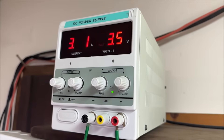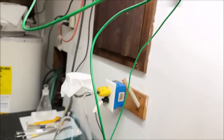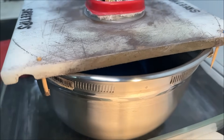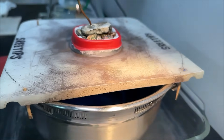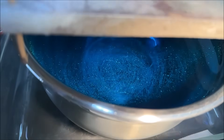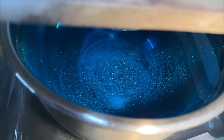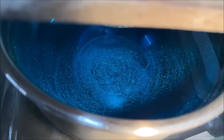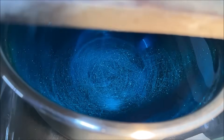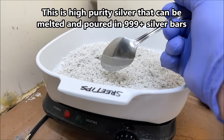The cell has been in operation for about 30 minutes now, and if you look down in here you can see that we're already starting to form pure silver crystal. See those crystals growing on the inside of that stainless steel cathode bowl — that's after about half an hour.